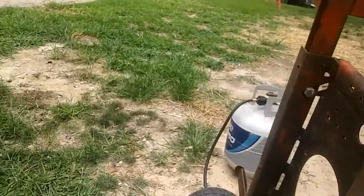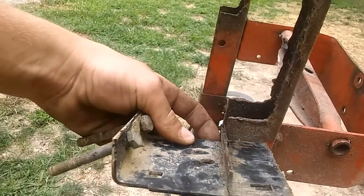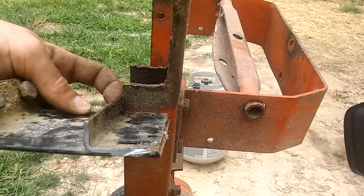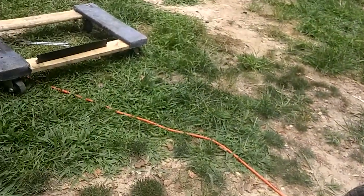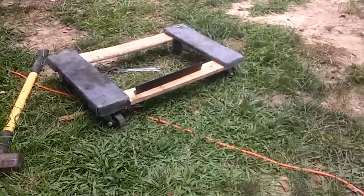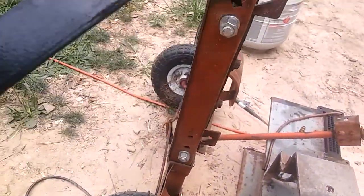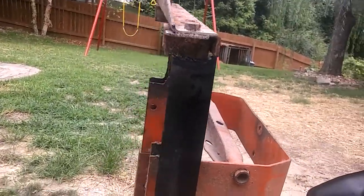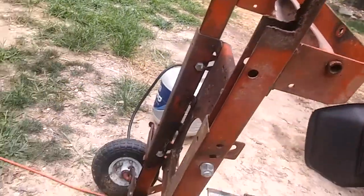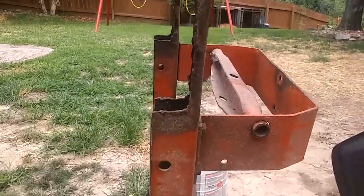What I'm going to do is grind that all the way back, and that will allow — when that lip is touching all the way up there — some room for it to set in there. So that's going to be where this sets, in the exact same position. And then there's this piece of stock that I cut with my cutting torch just a minute ago, and that's going to be on the outside here for extra support. I'll probably put another one on the other side if I have time, but if it's sturdy enough the way I'm about to do it, I won't mess with it anymore.